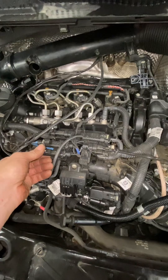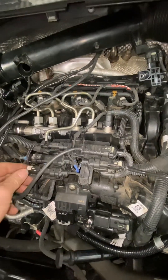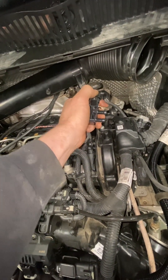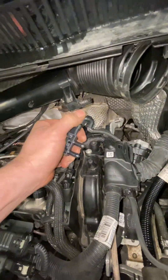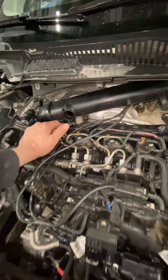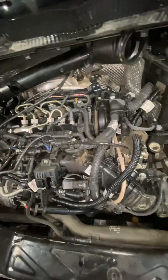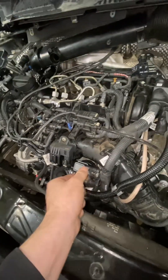On this B37 unit, we've got an issue with this temperature sensor here — it's showing 300 degrees, and when I unplug it it's minus 40, which confirms everything's okay with the wiring. The differential pressure sensor is reading around six millibar and it should be zero; when I plug the new one in it goes to zero, so there's clearly a fault with that sensor. I've also got a problem with the pressure sensor down there as well, so we've got three sensors on the emission system with faults.